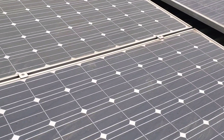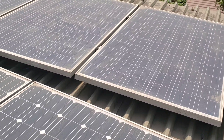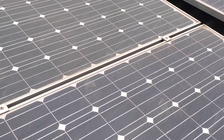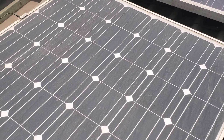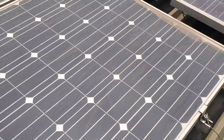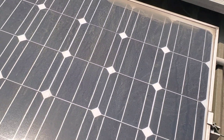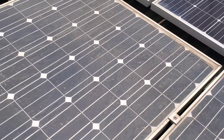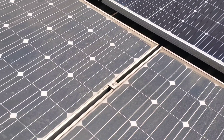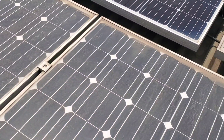Dirty panels can account for up to a 10 to 15 percent reduction in production. When you're like me and you're 100 percent reliant on solar, it begins to impact how well your system performs. Look at the edge of this panel — see the dirt accumulated there. That impacts performance because the bypass diodes get blocked, and once a diode is blocked you lose production from the section that the diode protects due to this dirt.